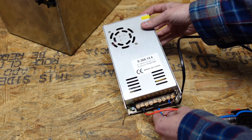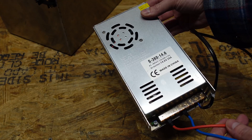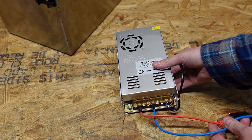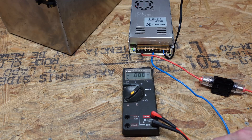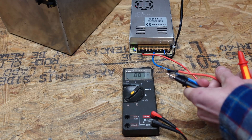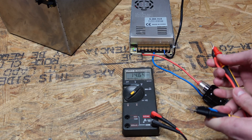Here's the charger he was using with it — I think he said this actually came with the battery. It's 14.6 volts, 20 amps. He said he paid $1,200 for this battery, and I can link to where it was purchased from Amazon, but some very cheap quality China components. The first thing I want to do is make sure this power supply is actually working. We've got negative and positive and we're seeing 14.6 volts, so that is normal voltage.